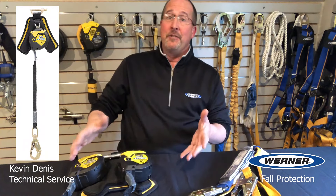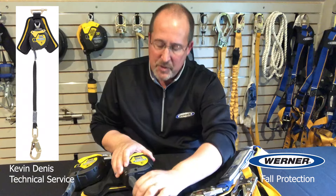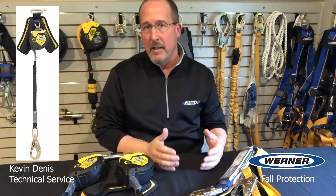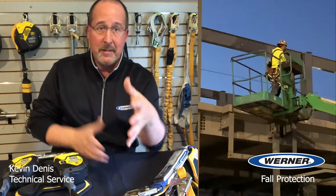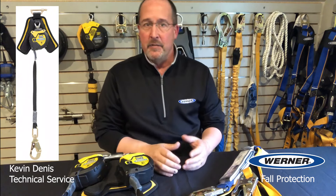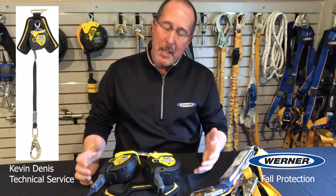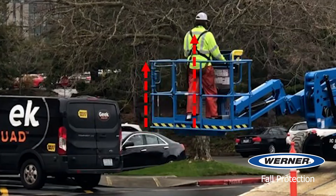Moving over to team SRL: people that favor this team like self-retracting lifelines for use in lifts because of their user-friendliness and locking speed. Due to the retractable nature of SRLs, you don't have that loose line hanging around your legs and knees like lanyards, so they're a little more user-friendly. In the event of an ejection, depending on how it occurs, there's also the chance the SRL might lock before the occupant is ejected and they stay inside the basket. The downside of SRLs is they're not as economical as lanyards, and due to the locking and unlocking nature of the SRL, the unit may lock and unlock a couple of times as the boom bounces. The anchor point in the vast majority of lifts is below the D-ring at the midrail level inside the lift. This lower anchor location and the top of the guardrail interrupting the SRL line make Class 2 SRLs the best choice.